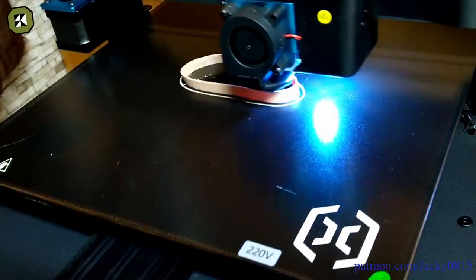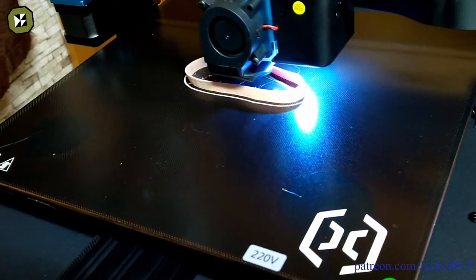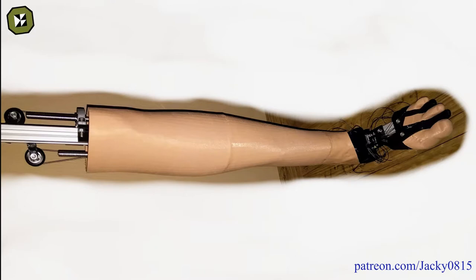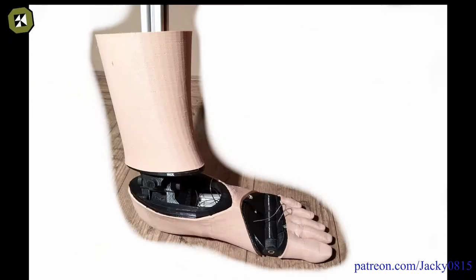I have also made several attempts to make a skin for the Android with TPU, but I could not find TPU that was stretchy enough for the joint areas. In mid-November I had finished the first prototype of the ankle joint and found out that the ankle joint could also be turned, which was not intended. Afterwards I redesigned the ankle to a universal joint.